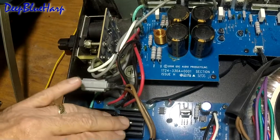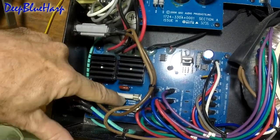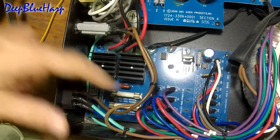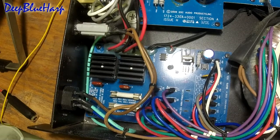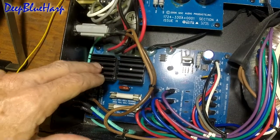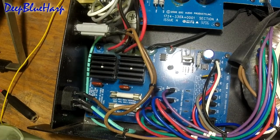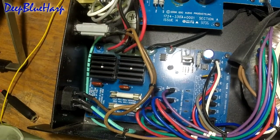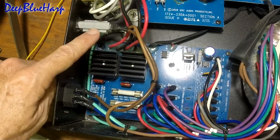Over here is the output, and right below here is the power board. The power board comes straight in from the toroidal transformer. There are two fuses in here. The circuit breaker for general trip purposes is here. If these two fuses blow, you have a major issue — suspect a short that may involve the transformer or other components. This will take high-end tech help to analyze. For your normal do-it-yourselfer, if these have blown I would send it back to the manufacturer. For all other conditions when this unit trips down, this is a 15-amp circuit breaker built right into the unit.